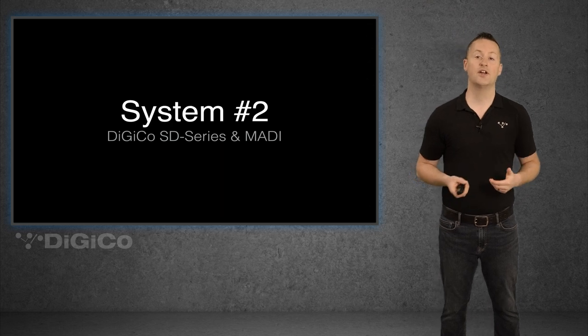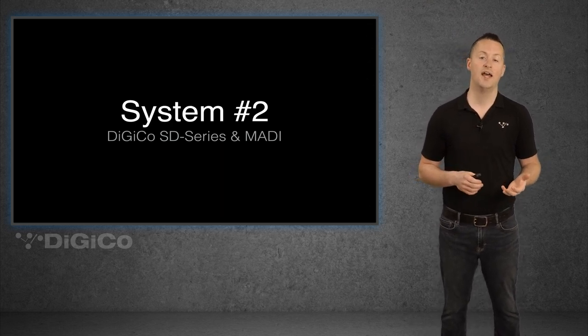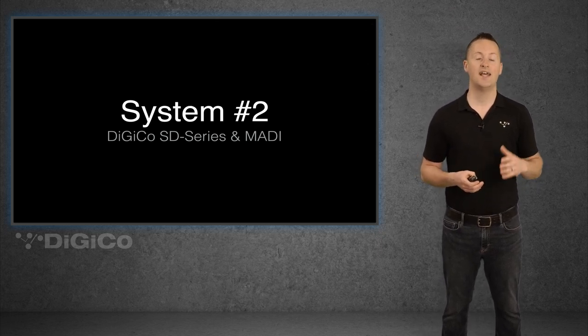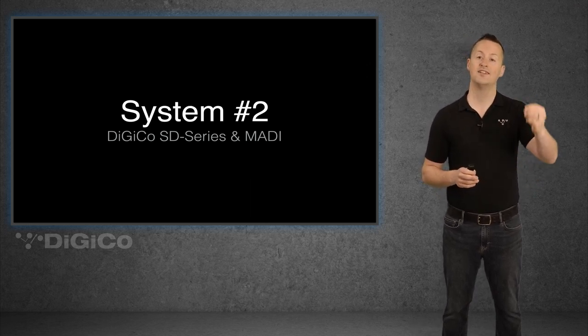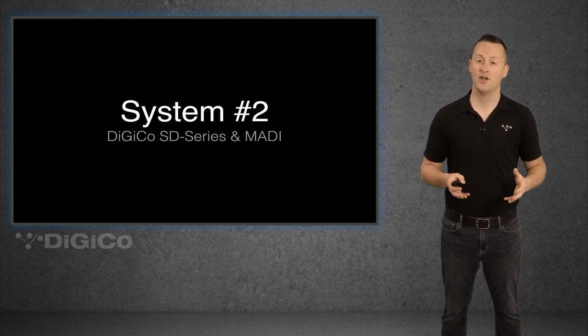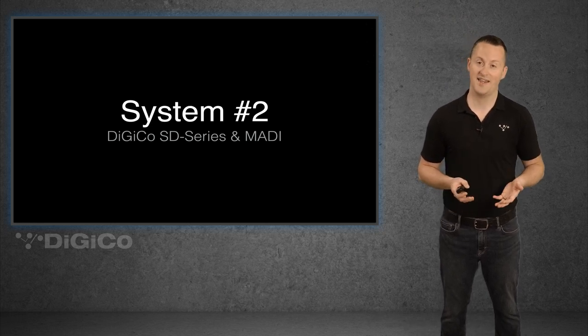All right, let's take a look at system number two. This is actually going to be based on DiGiCo's SD series platform, and the infrastructure is going to be MADI. If you're not familiar with MADI, MADI is a point-to-point system. It's not designed to be a network or a star like Dante is. It's designed to go from one device to the next, and it's designed to be incredibly easy. In fact, there is no software for it. You simply connect them together and they work. It truly is that easy.